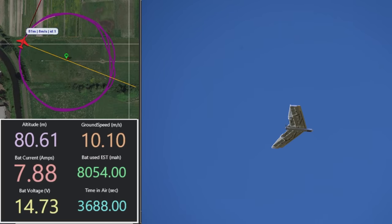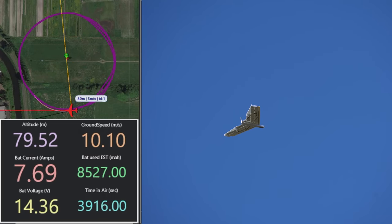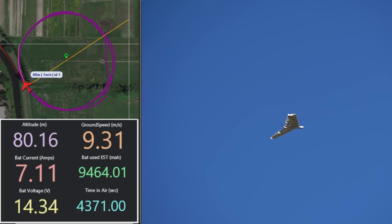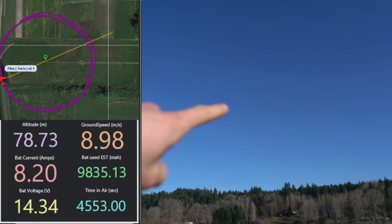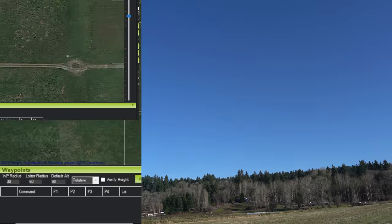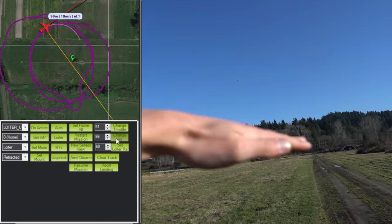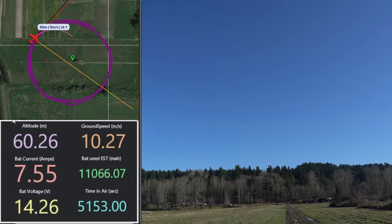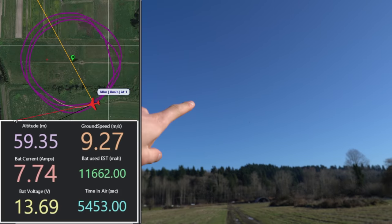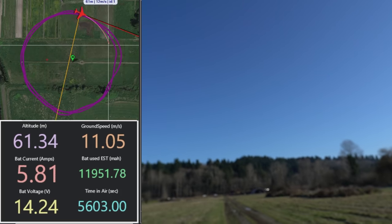Also, we're in Seattle right now, which is pretty far north. The sun is much lower in the sky up here than it would be down south. So I dropped the altitude down a few times via Mission Planner and it didn't crash. That increase of airspeed as it descended a little bit was what caused the aileron reversal last time. So that's good. That carbon spar in the back seems to be working pretty well.